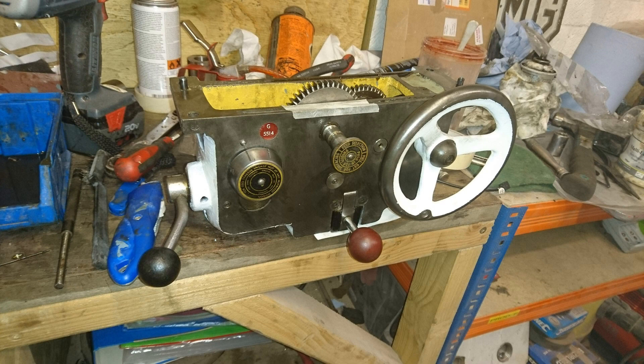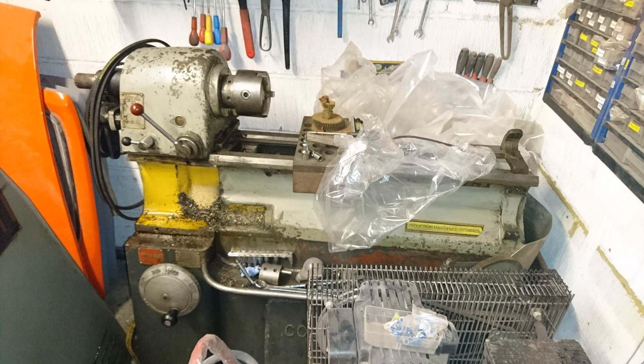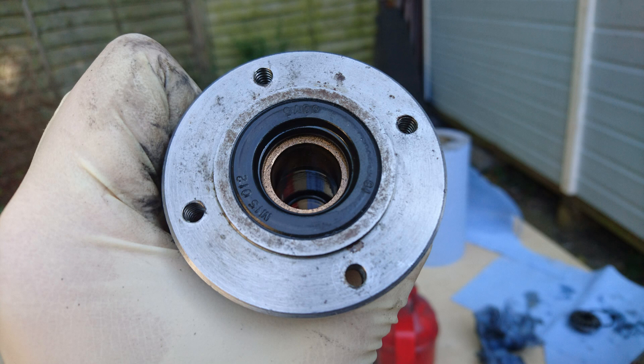The only thing I didn't like was that the handle had already snapped off before I got the lathe. There was also a big oil leak on the gearbox, which I would later sort out. The gearbox was working perfectly fine other than the oil seal, which had failed. Kent Bearings supplied me a new oil seal, and I cleaned it all up, put it back together, and replaced all the oil.